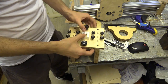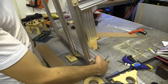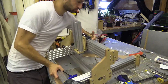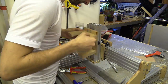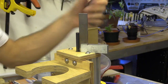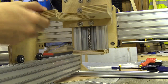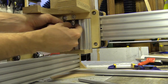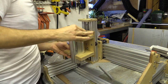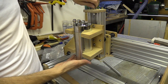I then placed a blank PTFE nut block onto the rear of the spindle mounting assembly, flipped the machine to its side and installed the bottom Z axis plate. I returned the spindle mounting assembly onto the C beam, and with the top Z axis plate in place I used a transfer punch placed through the hole of the bearing to mark the position of the lead screw on the PTFE. I drilled and tapped this and assembled everything back onto the Z axis, along with the aluminium shim and lead screw locking collars. Because I've yet to install the stepper motor, the weight of the spindle and low resistance of the nut block is forcing the lead screw to turn and the spindle to drop.